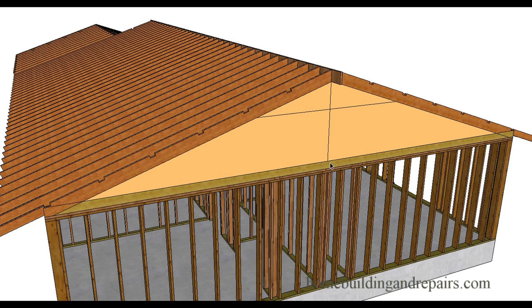The codebook says the measurement will be in the attic space area. What exactly is the attic space area? I would go from the top of the ceiling joist to the bottom of the roof rafters. However, attic space could also include the top of the roof rafter, since there is space between the rafters and space between the ceiling joists. Like a lot of building code issues, it doesn't give you an exact detail, but this is close enough.